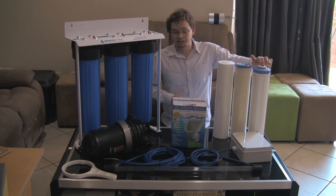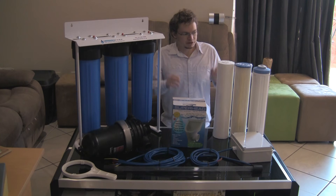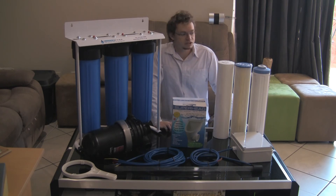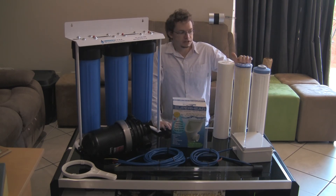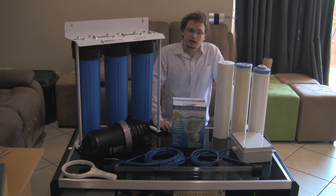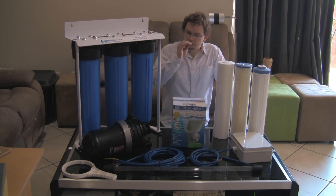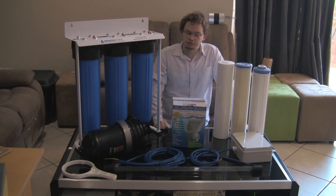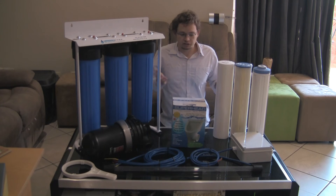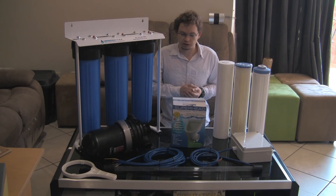The KDF prevents that as it actively kills bacteria growing in the filter. This system can be hooked up to a house. It's not the highest flow solution — with a single 0.1 micron filter you'd be limited to about 1,200 litres per hour, which is sufficient to run about two showers. You'll notice a slight loss in flow compared to municipal water, but for emergency situations it's more than sufficient, and it's a relatively simple solution with relatively low maintenance.